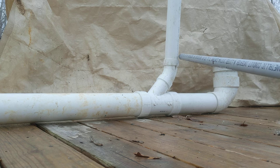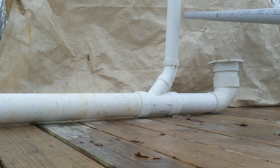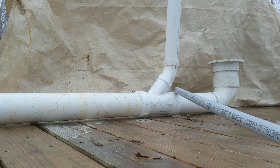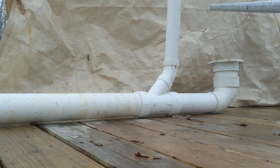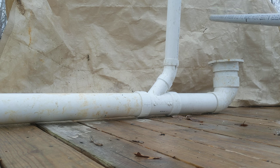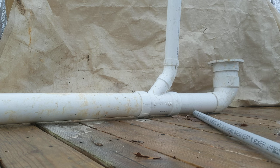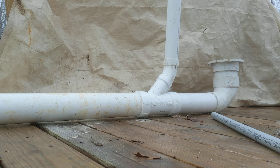This is inside the wall — you have to picture a wall here. This vent will go through the bottom plate of the wall, through both top plates of the wall, through the roof, or it will tie in in the attic to a bigger — probably a three inch — main vent pipe. A lot of times these toilet vents are by themselves, or they'll tie into another one inside the attic. If you see a two incher poking out the roof, it's just running one thing.